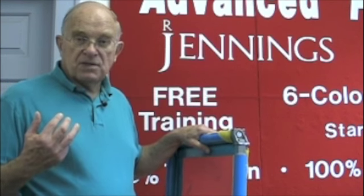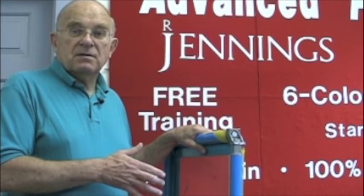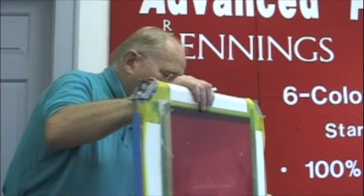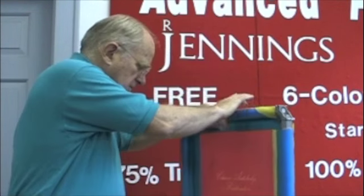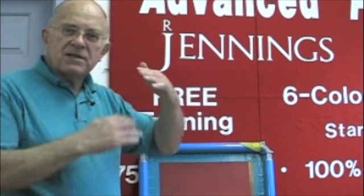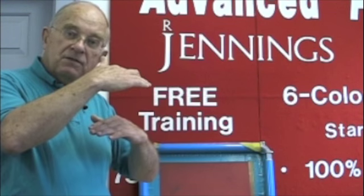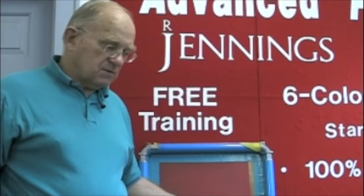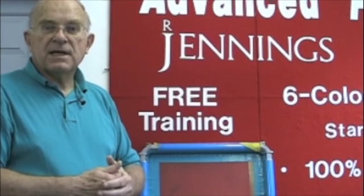In those 3 jackets that we saw, somebody stretched those screens up probably very nicely, but before they actually went to print the job, the mesh had lost all the tension. And so when you print, what you're typically doing is taking a squeegee and you're pulling it down the screen, and what that does when you're printing, the area over which you have passed, the mesh is extended like a rubber band. It's tight. But the mesh in the screen in front of the squeegee is compressed, and it forms a wave. And then you find people trying to say ergonomic squeegees. That's all nonsense. You don't need that. You want the screen to be tight both before you've printed and after you've printed. You want the mesh to always stay tight.